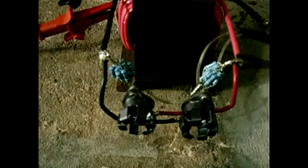I tried putting capacitors across the 120 volt output — all that did was increase the frequency. I also tried various capacitor values between the base and collector and between the base and emitter, but those had very little if any effect.